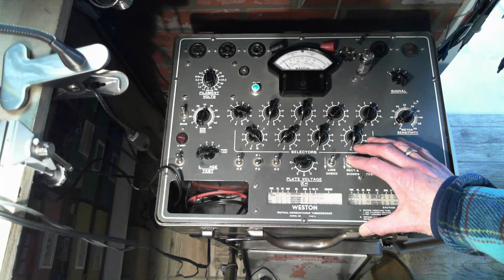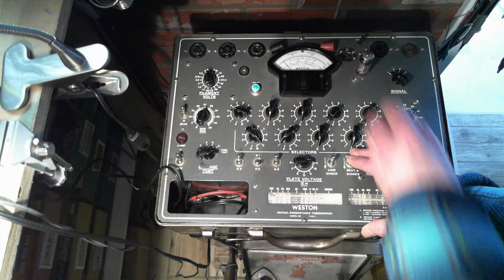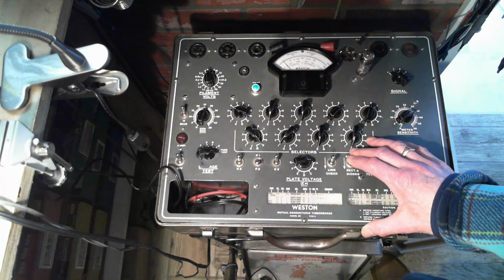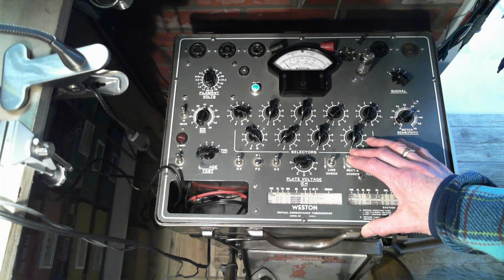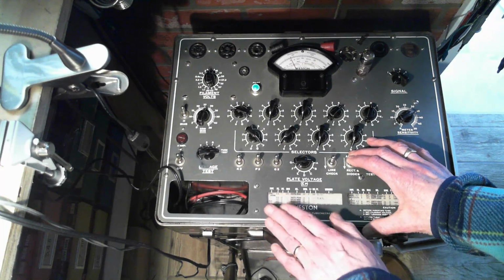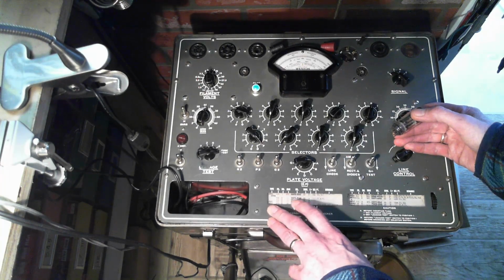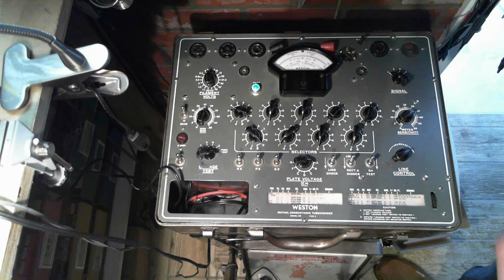That's not so good. So I have one weak diode in this tube. Ooh, what would that do? It's only coming up about halfway to the mark. Is it this? No, it's not. It's probably okay to continue using it at this point. I don't think it would explain a dead radio. It might explain a low output or some distortion or something like that. So we have a little bit of trouble on this tube, but not enough to explain a dead radio.